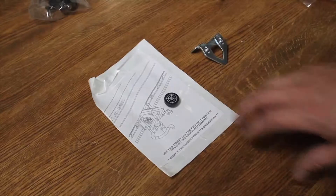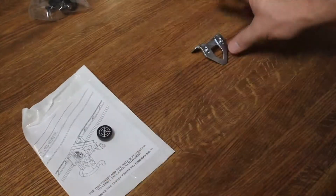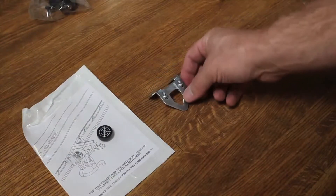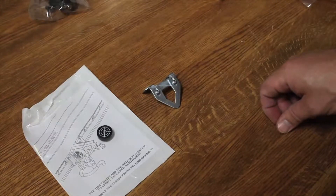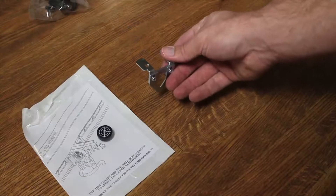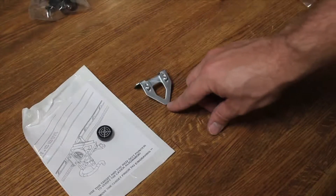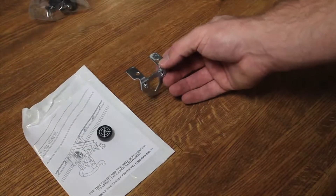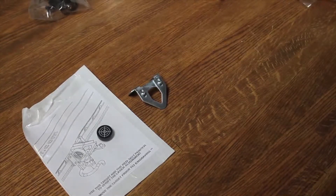I've actually never used one of those before — all lasers I've used have already been calibrated. Moving on, this next item — I actually don't even know what it's called — I use it to focus the laser on the material. You set this on top of the laser and raise the table up and down until the very tip of this touches your material, at which point you can see this piece raise up slightly, and then you know your laser is focused on the material.